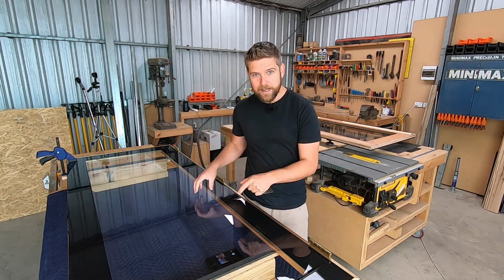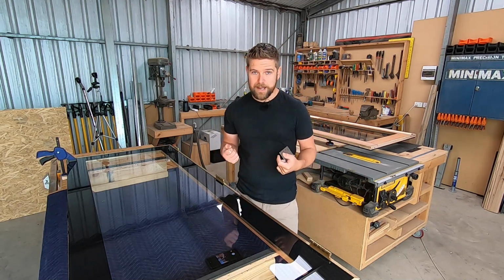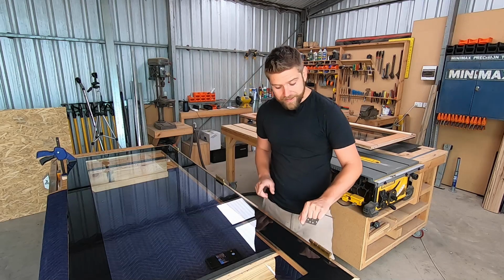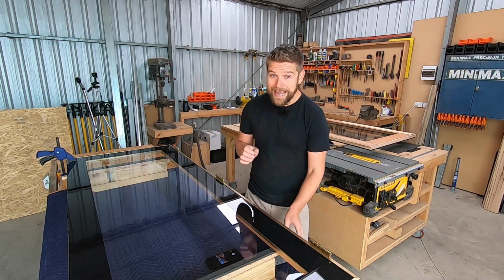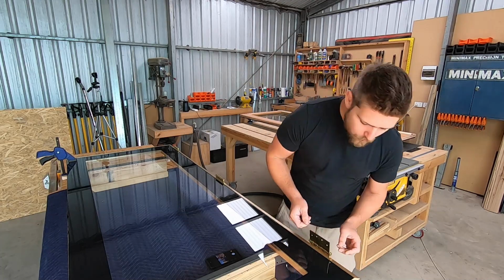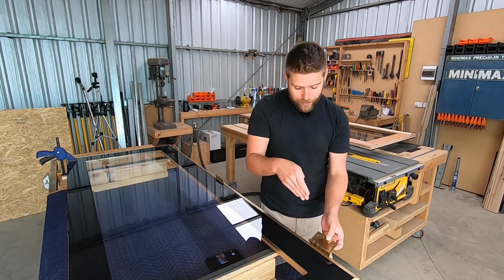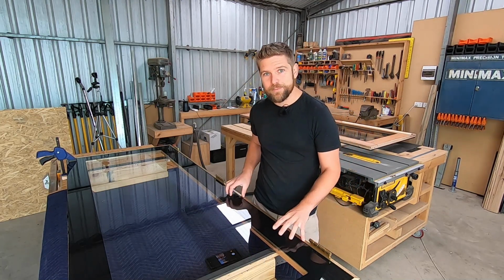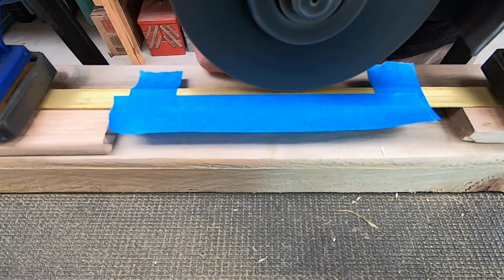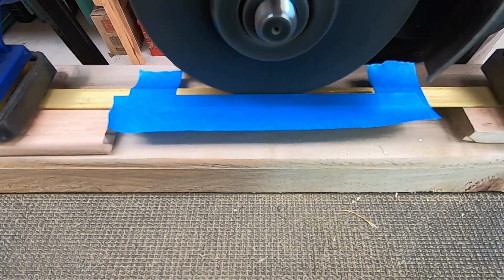this is all designed so that if I have to replace a piece of glass, I can just cut the silicone around here and these brass trimmings all lift off, except for these, which will just be a little bit different. So what I just ended up doing was cutting a slit into the brass here that goes down through the brass trimming and then it is rebated into the timber of the door. And that, oh man, was just a fiddly, tedious job.